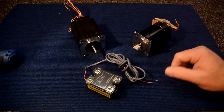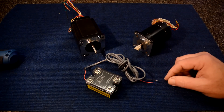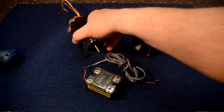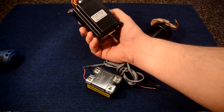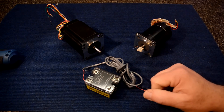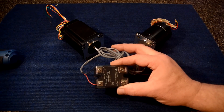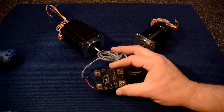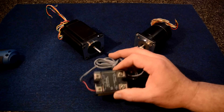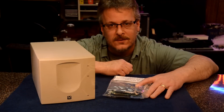These are some of the motors you would typically run with a stepper controller like this board. These are fairly large motors that can run a medium-sized machine. This is a 305 ounce-inch stepper motor, meaning it can hold 305 ounces of holding power. It has pins that you can put on relays to control things like vacuums, pumps, and spindles. So you can expand with relays - it's just a simple board that works well and is easy to understand.